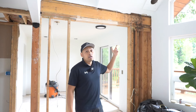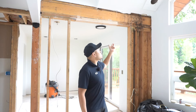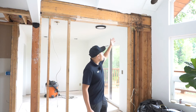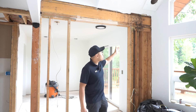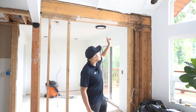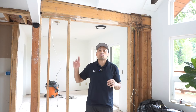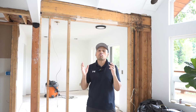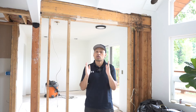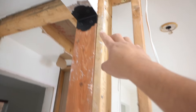Unfortunately this one is pretty much close to collapsing. I'm very thankful that the damage didn't go further in — it stopped right at where the 2x6s are here at the wall, so the damage did not spread. Once we go and jack this up and replace the beam it's actually going to be more structurally sound because it's a lot thicker — six inches thicker. We also added brackets here because this is load-bearing. We put more on the back side. This is the one I was telling you guys about where they used the wrong stuff — they just nailed it, but they should have used the heavy hardware.